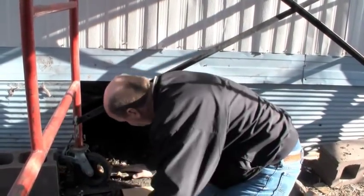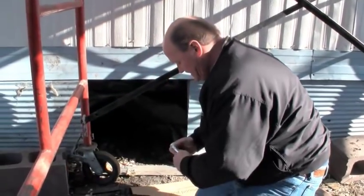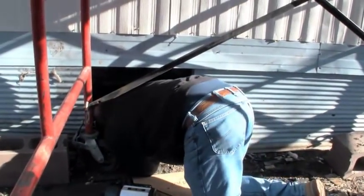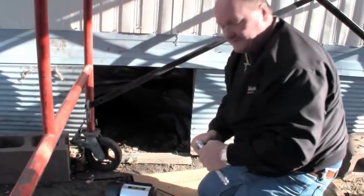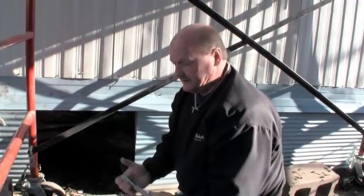I'll take a look and see if it's got a hanging belly — I'll need to know that for the audit. This one is actually a flat belly, so we'll be able to use that 3½ inch cavity to determine the amount of insulation we need.